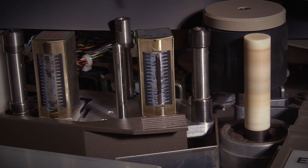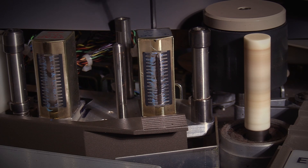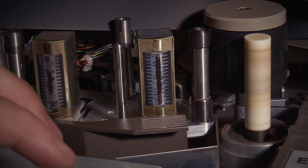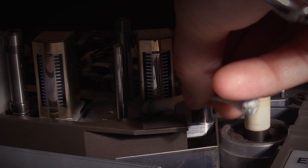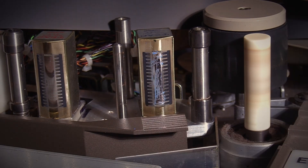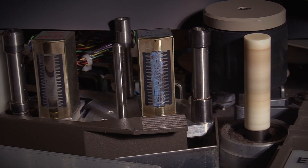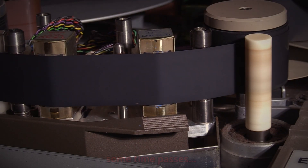That was kind of a big adjustment, but let's see what we get. And that's what I was trying to say before — the way the manual says to do the head contact test seems really hard because the adjustment is just so coarse. Let's start with a fresh slate, clean off the head with some alcohol, and put some more china marker on it. I'm putting more than you probably need, I just want it to be as clear as possible for the camera.